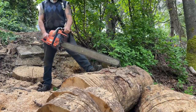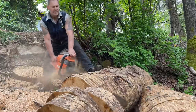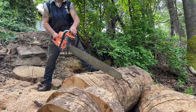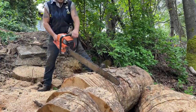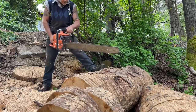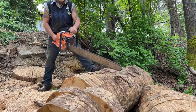So friends, this thing is absolutely beautiful. These were a lovely saw. They had their day in the bush, these things. I'm telling you, they're lovely. Anyways, friends, this thing is really fat. This is my first run. It doesn't have a governed carb, which is that brass screw in there. You know what I mean? I piddle around a little to find out how fat it is. I cut with it and I tune it and get it singing, but I'm not going to bore you with all the details. This thing's beautiful and the clutch noise goes away. It was just so dry.